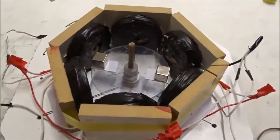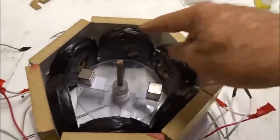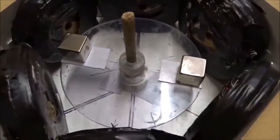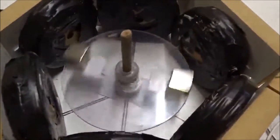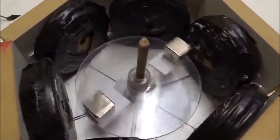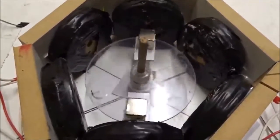It's hard to synchronize a permanent magnet motor to get it started at the very beginning. What I've done here is made six wire coils, put them in a tight circle, and put a little magnetic rotor with two cubes on it. I've wired this thing up with standard UVW three-phase power. I've only put three coils. We're going to put on like one hertz of power so it'll go very slowly. What you can see is these magnets are trying to line up with one coil or the other, but they just waggle back and forth and can't seem to do it. Let's wire up all six coils next.